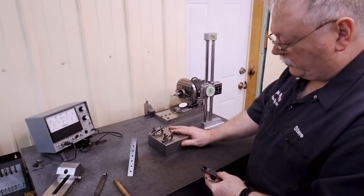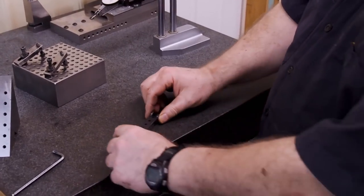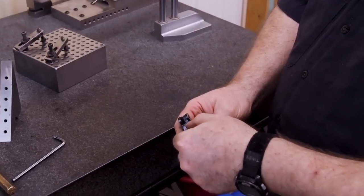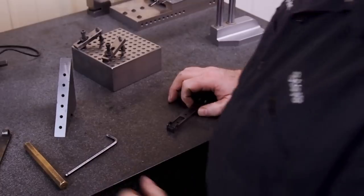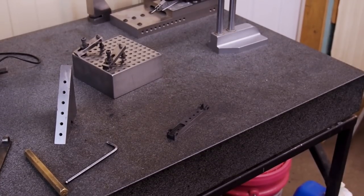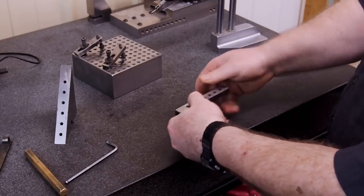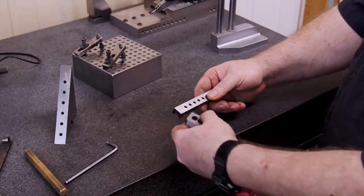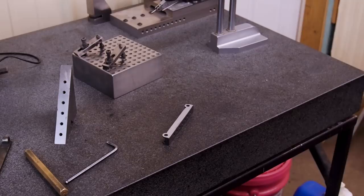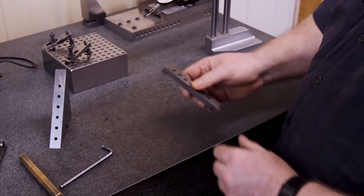You can adjust things with the pressure on the finger clamp and tweak things down to 50 millionths without a problem. One other thing I could have done on this block — I could have lightly ground this surface, then used some countersunk blocks and tap toes to bolt them down. You can set it up, grind that surface, leave it bolted, flip over, grind, and then use your coolant without worrying about the problem either. I wanted to demonstrate the versatility of the cube. On this part, we'll leave it like this and move over to the jig grinding in another part of the video.